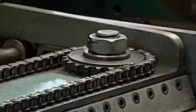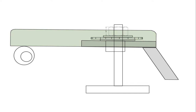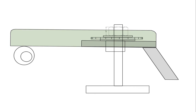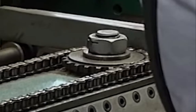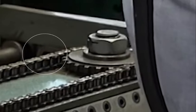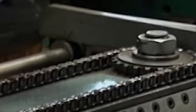I can't help but feel that if those eccentrics are rotating around — even if that thing is rocking back and forth just a couple degrees — it's going to wallow out and kind of grind an oval shape in the holes in the plate. So I feel like there's got to be some more elegant solution underneath there that we just can't see. There is a little bit of a clue: there's some kind of curved bar supporting that rocker, but it doesn't seem to slide underneath the rocker when it transitions forward and back around the eccentrics. It's some kind of hidden structure that I don't know the purpose of.